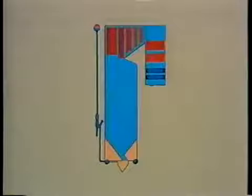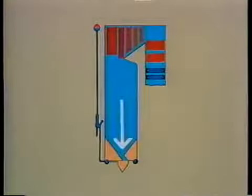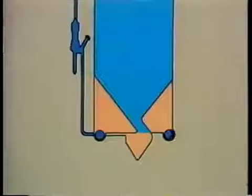Another component that requires inspection is the bottom ash hopper. Now, the bottom ash hopper must be examined for 5 problems that affect the refractory inside the ash hopper. These are the effects of rapid temperature change, ash buildup, erosion, surface deterioration, and problems in previously repaired areas.